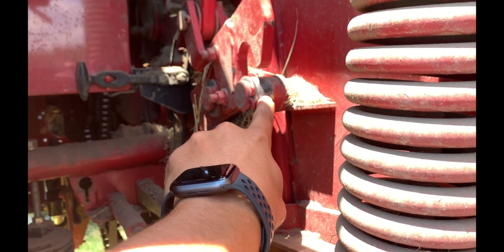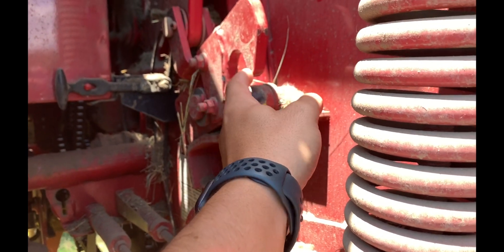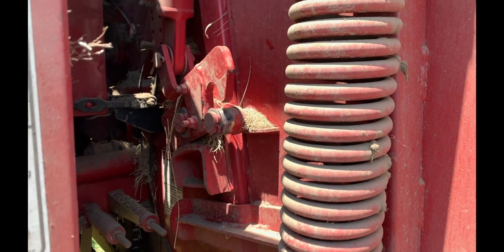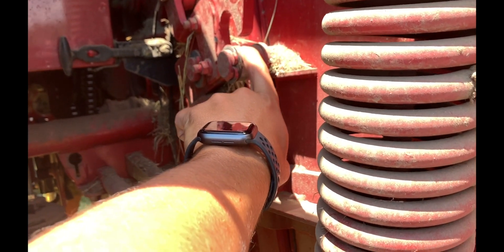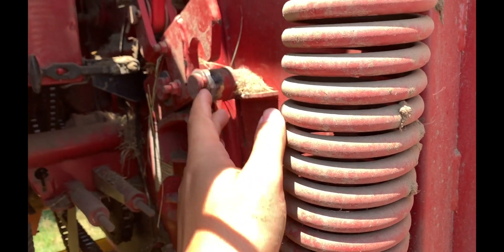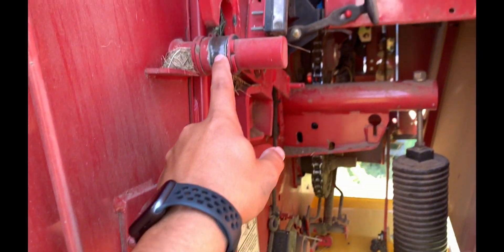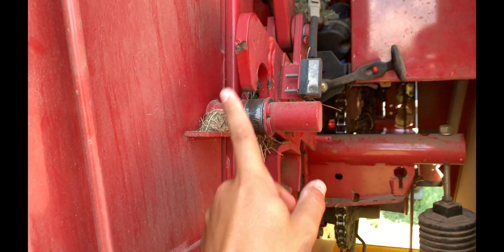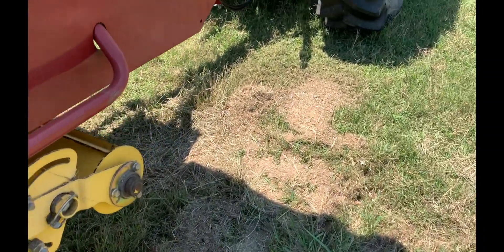These lock latches come down and lock, but this side needed adjusted — it was barely catching. Right now they're not locked because I let the tailgate down. You have to have the tractor running to get them to lock. This side was only down this far, so when the bale got too big it actually popped this lock off and pushed the tailgate open. Part of the bale was sticking out. I hit the other latch with a hammer and it finally popped off so I could get the bale out.